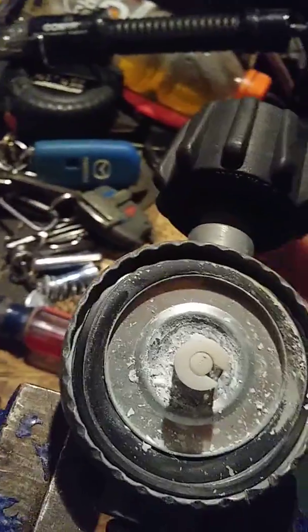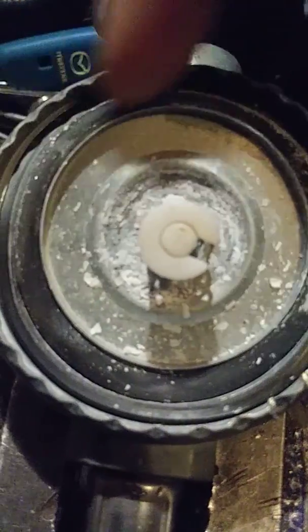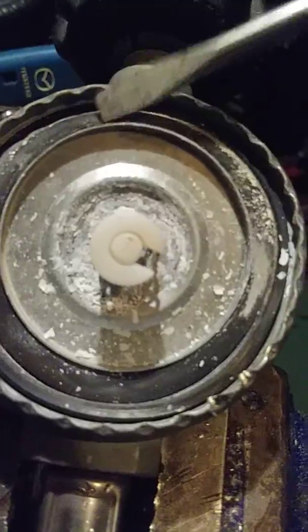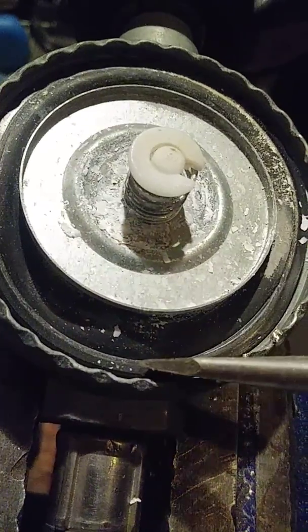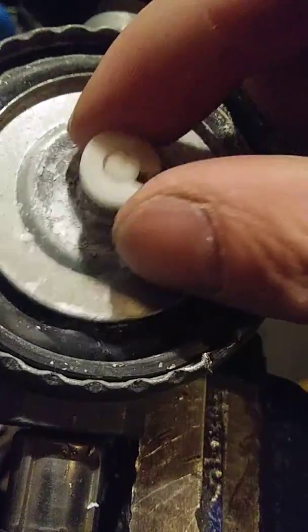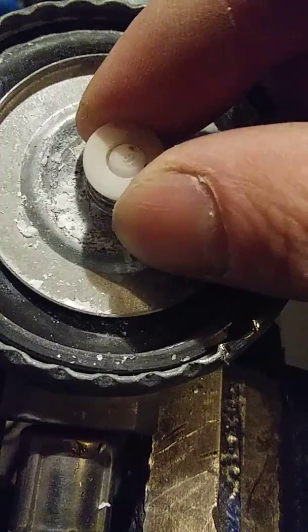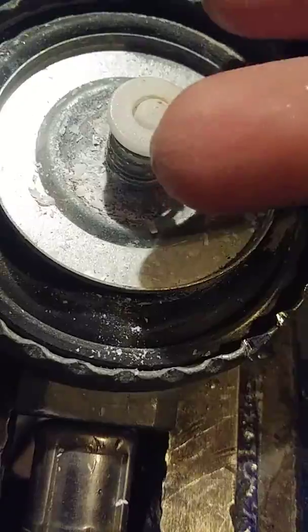This one was leaking — and there's where it is. Did you see that? See how it's ripped right there? It's not ripped up here, but right here is where it's ripped. It goes past this kind of diaphragm. It also seals on that edge there and doesn't move a lot — just a little against that spring — but it wears out with age and temperature.